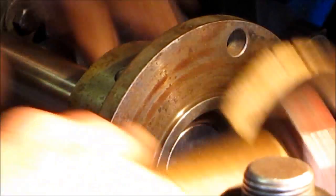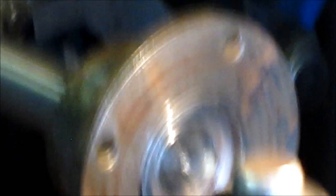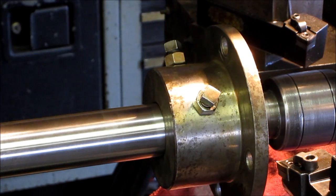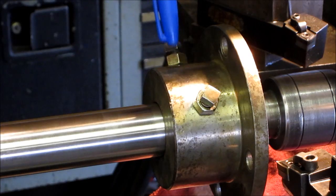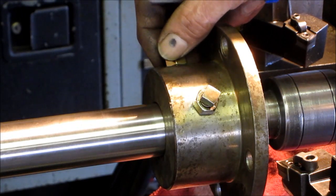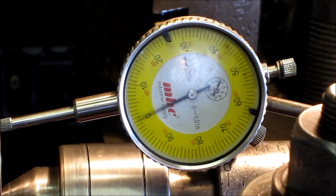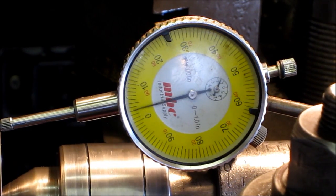Alright, line up the dimples. We're ready to do a fitting phase. If you can't find square heads with a hole in them for tie wire, go ahead and install your same-size nut — these are 3/8 square heads, so a 3/8 national coarse nut. You can cinch that nut down and lock it just like a jam nut on the end of your propeller shaft. We're just throwing the indicator on here just to see where it was — we straightened the old massive bend out of this thing, and now we're going to face it off and it's back 100% running true.